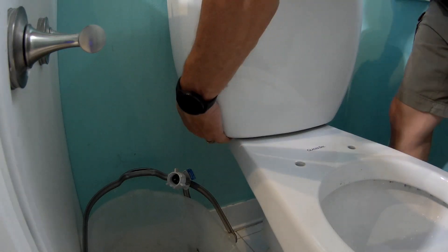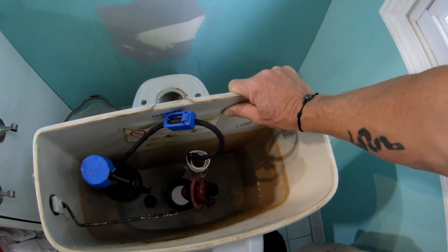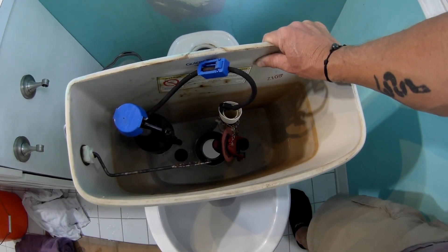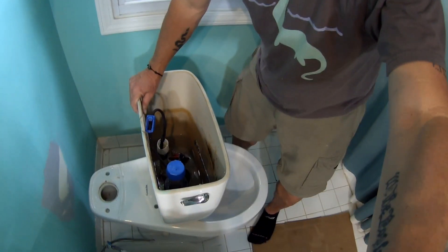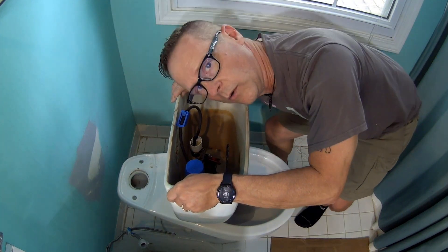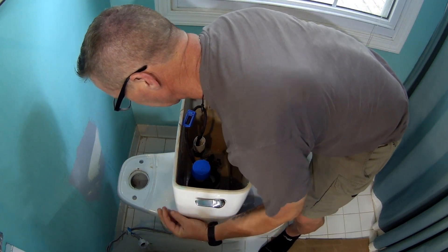What I'm doing here is I just removed the back. I'm going to dump water just into the toilet, and then I'll plunge it down and we'll go from there. I'm totally worried that I'm going to drop this entire thing. What you might consider is getting a friend to help you, and also maybe taking a rag and blocking the opening so that you don't spill water anywhere.